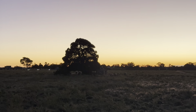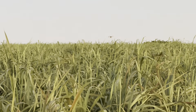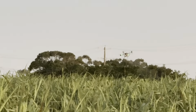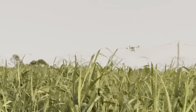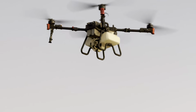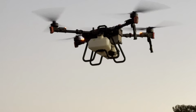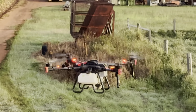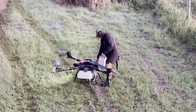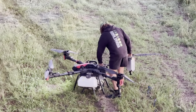Some more footage of the sun coming up — it's always spectacular. You can see here the routes of the drone; these are the routes the drone was actually taking, an east-to-west routing. We navigate the drone in using guide points to get it into that section of the job that requires spraying, and as the drone finishes spraying it's guided out using guide points as well. That way we can manage any obstacles in the field. It's also important to get the heights right because the sugar cane is quite high — if you're not careful the drone can drop down the side of the cane and impact it. So one of the first things we like to do is measure the cane to make sure the drone never drops below that height.